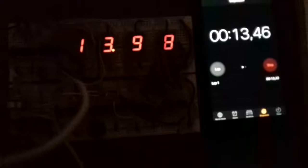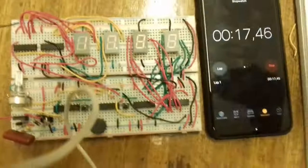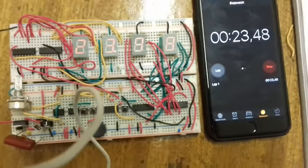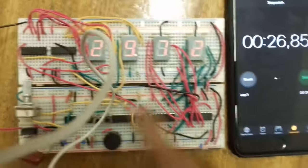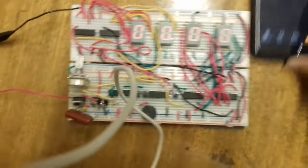Because I'm using a 555 timer circuit, the timing won't always be perfectly stable. Increasing or decreasing temperature will change the output frequency of the 555 timer, which means the timing will differ. Let's stop and reset - the timing will vary with temperature.